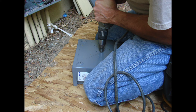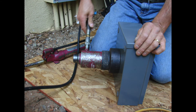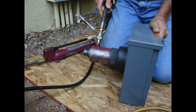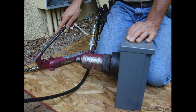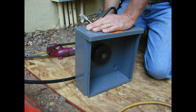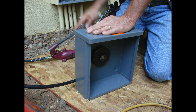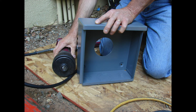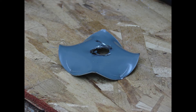We're going to prepare our rain-tight screw can to intercept and get into the wall behind the stucco, just below the main panel. We've got thick stucco that we have to penetrate to get into the wall, so we've got to make a good-sized hole into this rain-tight screw can. We're using our knockout punch set — drilling a hole through the back after using our unibit to make a hole large enough for the main bolt for the knockout. We repeat that process for all the other accesses going into this rain-tight screw can.